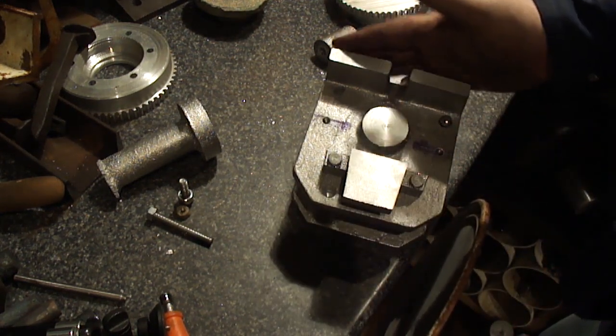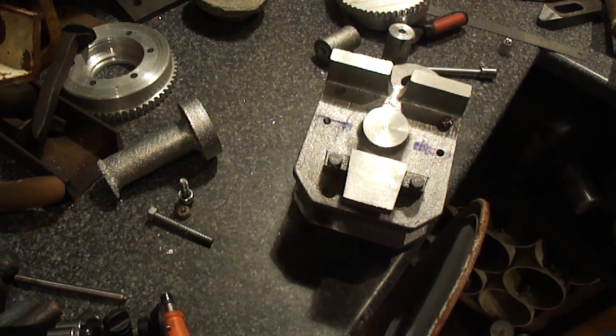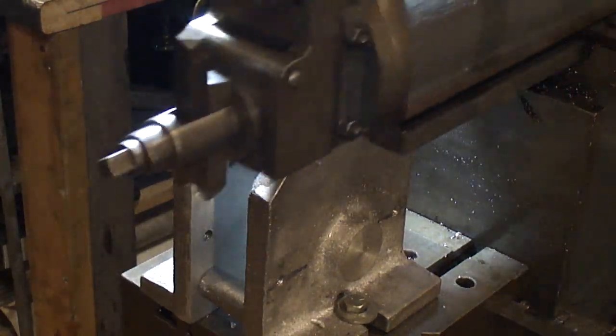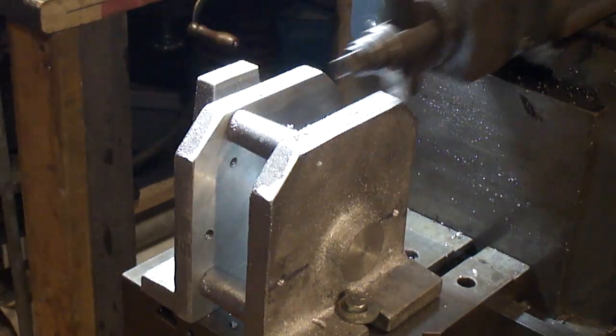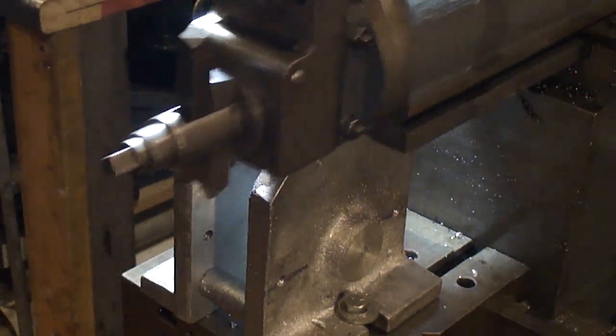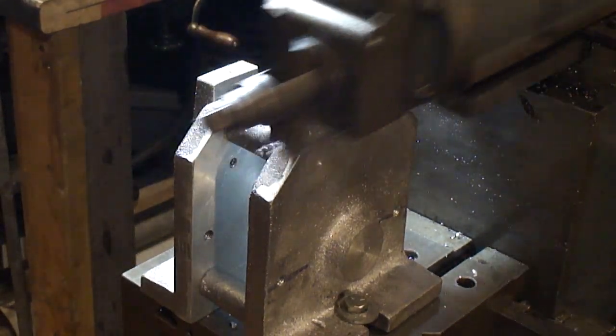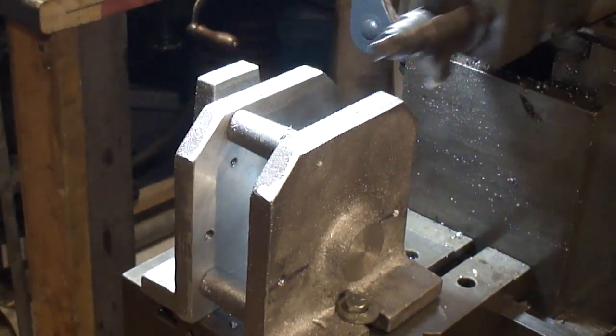I got this put together and we'll come back. I'll stick this on the shaper and clean off the top, then flip it, put it on, and face off the bottom. Facing off the top — I know this one's a bit taller than this one, so it's screwing me up a bit. I was cleaning it all off so it's all parallel across, and then we'll flip it.